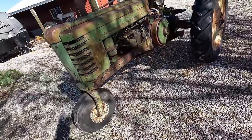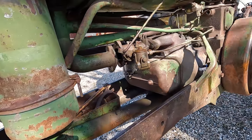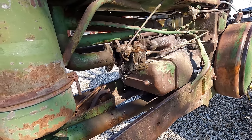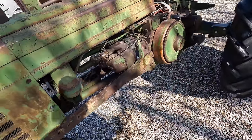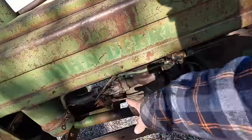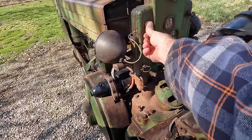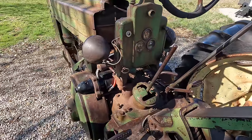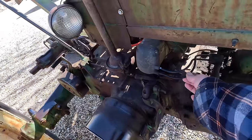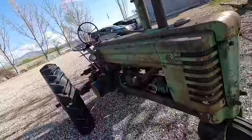I think that's all I'm going to get out of it in this condition — I just can't keep it running because of that carburetor. I turned the fuel back on just to show you how bad this carburetor is: we're getting a really good flow from the tank but it's just completely overflowing — the float isn't working at all, it's coming right out the end. So that's why I can't keep the engine running. But the good news is the motor sounds pretty good to me — sounds like it's got good compression and it was popping off like a John Deere does. So at the very least we're going to need a carburetor kit, and I'm going to have to rig up some type of a starter switch on the dash since this button just isn't doing anything. I don't think it would hurt to get a new rotor too because that one was quite worn, and I think I'll also get some solid copper core spark plug wires and probably some better quality spark plugs. Once I get all that done, we'll be able to start it again and keep it running, and then we'll check the transmission, brakes, PTO, and everything else.